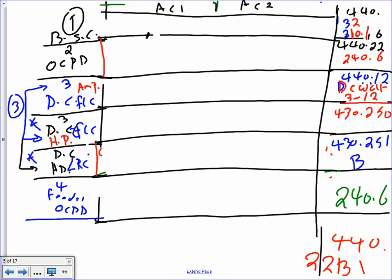The way that you do the conductors, no difference than you go to 440, look at this, 440 this time, not 430. That's .32, and then don't forget to go to the table that I'm going to change there. This is 440.32, and this is Table 310.15(B)(16). Really, no difference. And we just modify these because of that. This will be 440.22 and 240.6. Okay, so these are your references. We worked them before, guys. All right, so piece of cake.